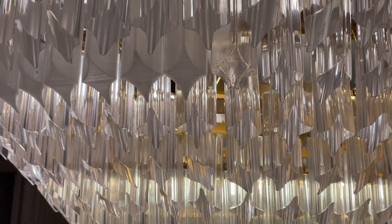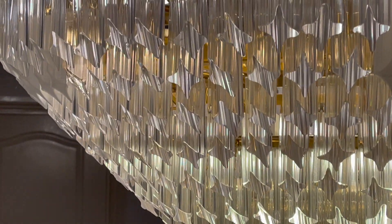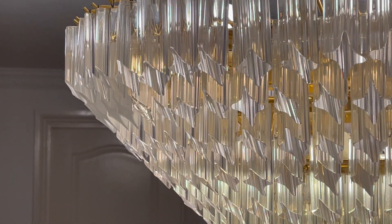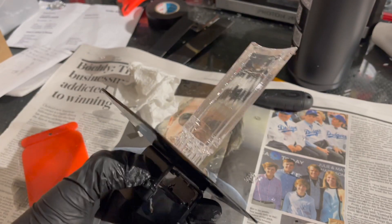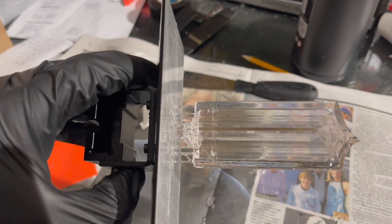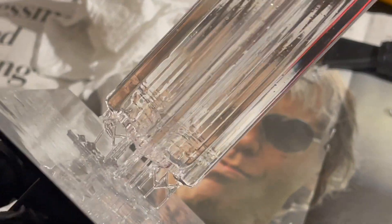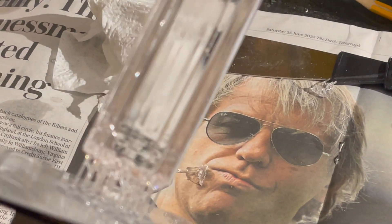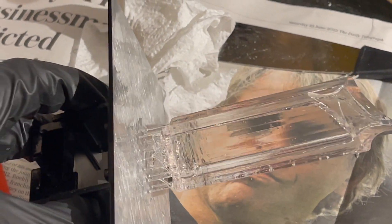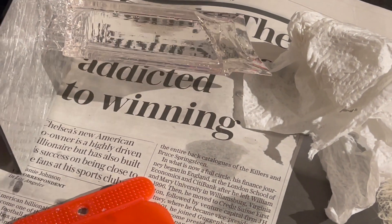A quick coat of clear lacquer and then I've added it to the chandelier. The challenge is: can you spot the 3D printed one? It's looking much better than the FDM counterparts. From the side you can barely tell that it isn't one of the original glass chandelier pieces, and had I done the tip solid you probably wouldn't have noticed at all. I've got to do a few of these chandelier pieces, so I decided to print another one. The first one was slightly overexposed, so I measured a known thickness of the chandelier and used the size that was printed on the actual model versus what it should have been to reduce the exposure time from 15 seconds to 14 seconds — and that seems to have worked much better. I also reduced some of the supports at the bottom so it wasn't such a conglomeration, and that has also worked better.